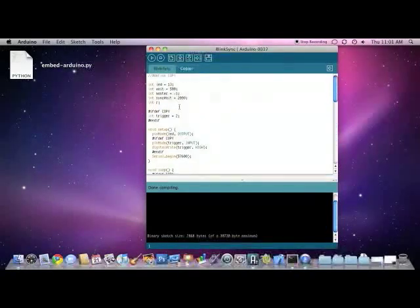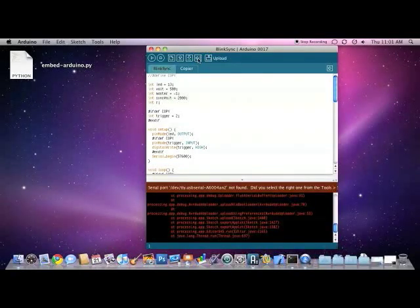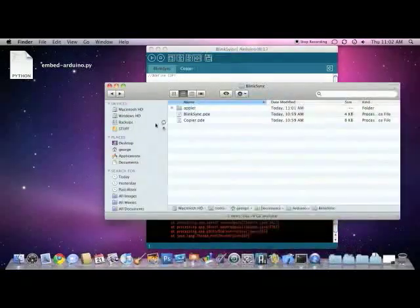But what we want to do here is be able to upload it onto one Arduino and then have that Arduino copy it over to another Arduino, which can become the slave. So what I've done here is, up the top we've got a macro define copy. If that's commented out, it is going to compile a regular version of it without any of this copying stuff. So we'll just choose upload, which won't actually upload it because I've disconnected the Arduino, but it does compile it.